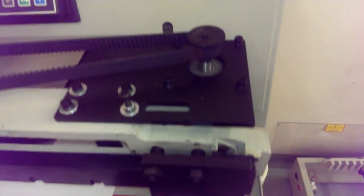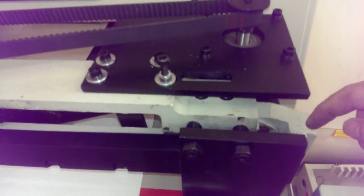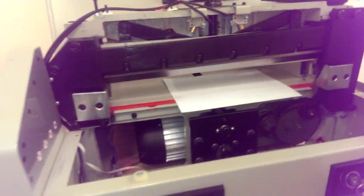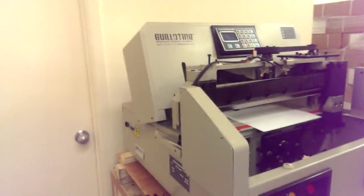But since we don't have this on, you can use the blade adjustment, that same screw we were working with the 6mm Allen wrench. You adjust that to get it to cut all the way through. So basically, it's just doing a test cut. Let me plug it in for you, Chris.